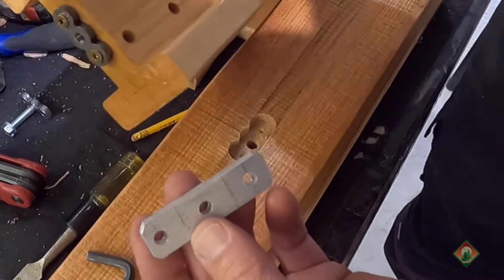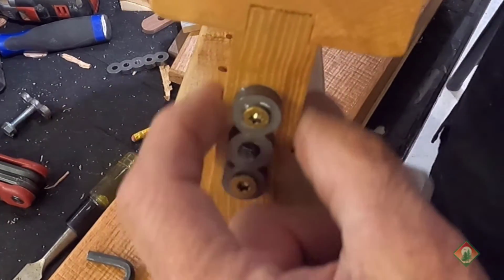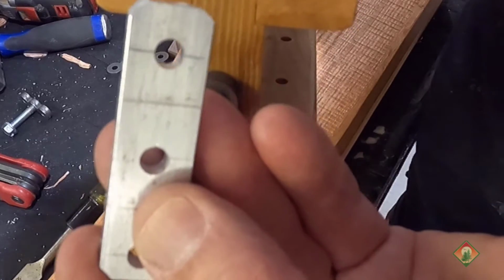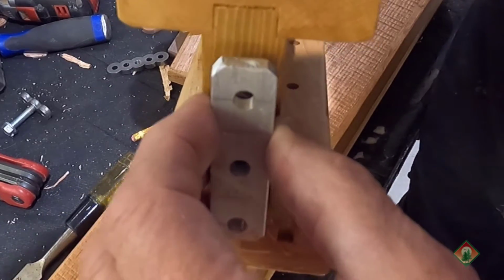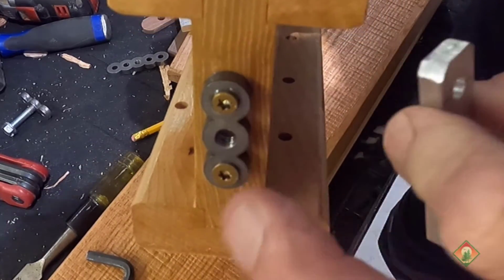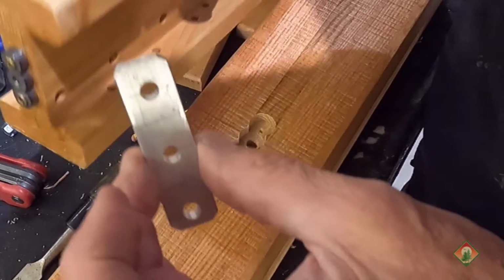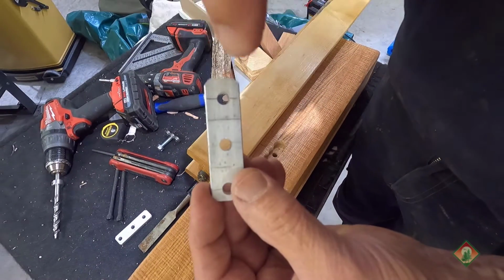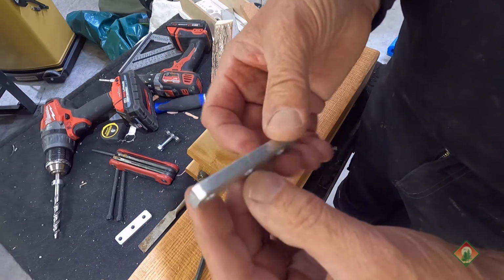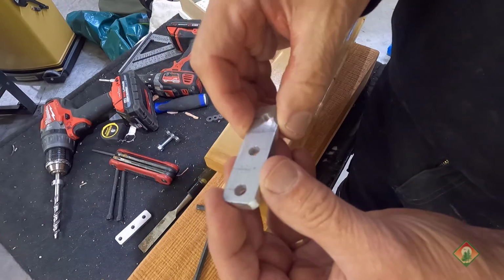Again, the reason they're smaller is because everything up until now has been 1 inch across, right? But 3/4 inch lumber is so common and so available that if you went to a 3/4 inch tenon, then you don't have a shoulder, right? And you're probably going to see a little bit of the edge of the mortise and things like that. So by going down to the smaller size, that allowed it to go into the whole different spectrum of materials, right? You can get 5/8 by 1/4 in flat, in mild steel. I think you can get it in aluminum. I'm not sure. And I'm not sure about stainless steel if you're doing outdoor stuff. But outdoor stuff is usually going to be bigger anyhow. Then you want to go to the larger tenon.